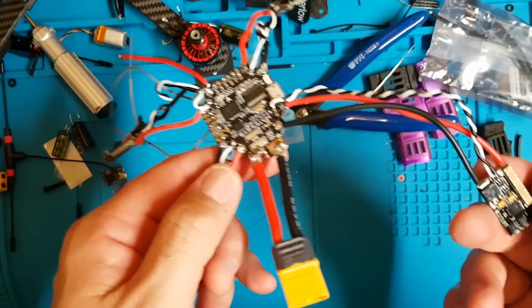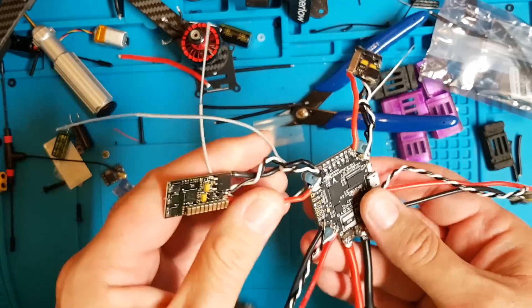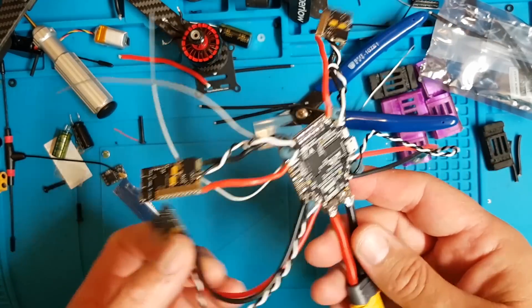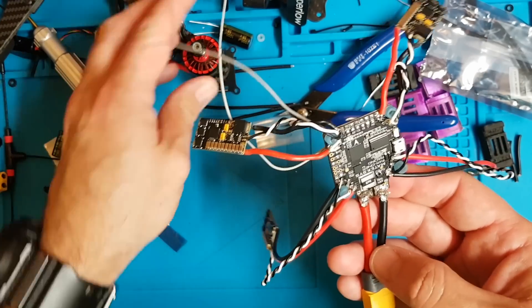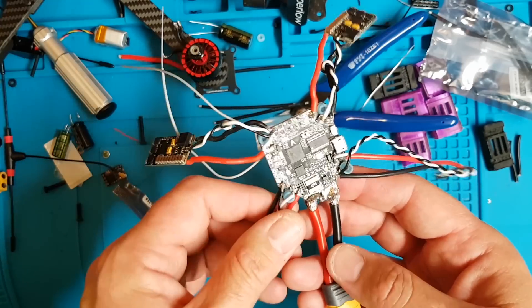They're all now running 32.6, which is the latest version for these particular ESCs. PWM frequency is on 24kHz for all of them. Nothing else has been changed — I've even left motor timing at auto, simply because I could mess around increasing it to squeeze out a little bit more power, but I don't need it unless I have desyncs.